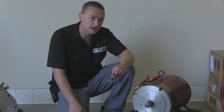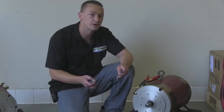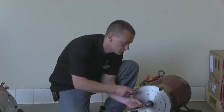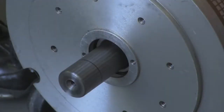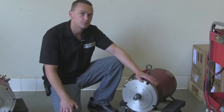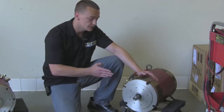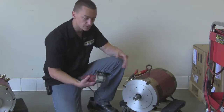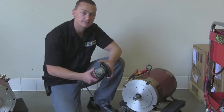I have my caliper set at an inch and a half, and what I'm going to use is a 12-volt battery to spin the motor shaft as I mark it with my permanent marker. Now that our motor is marked, we're going to use the same 12-volt battery and spin the shaft while we cut it, which is going to ensure a true cut all the way through. I'm just going to use a regular four-inch cutoff wheel — you can get these at Home Depot or anywhere like that.